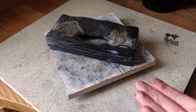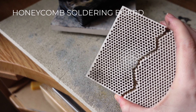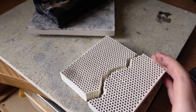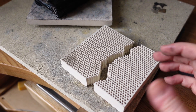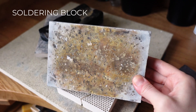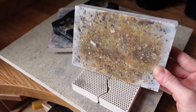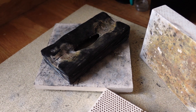I also have this type of board which had a little accident, but that's okay — it helps when I need something to place between pieces and hold them together. Some people break these on purpose to get different layers and heights so you can support the metal you're working on. My very first soldering brick was a very simple cheap brick from Cooksongold, available almost everywhere. It was great, but it doesn't reflect heat as well as the charcoal block, so once I moved to charcoal I never looked back.